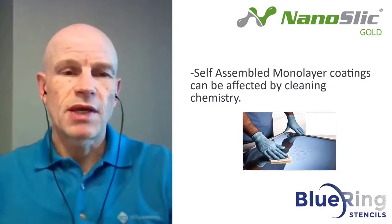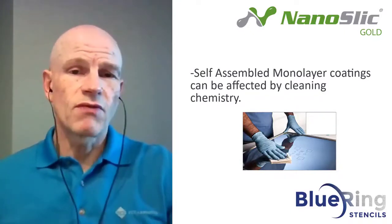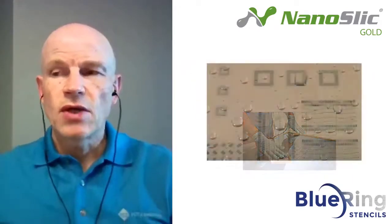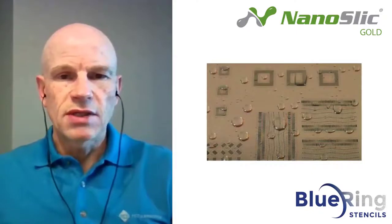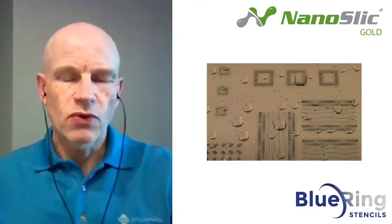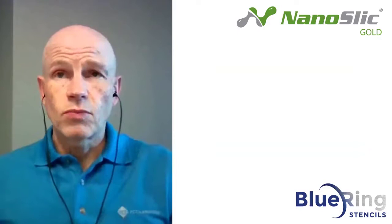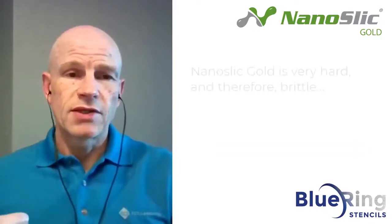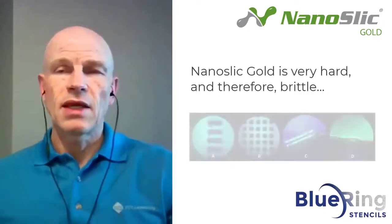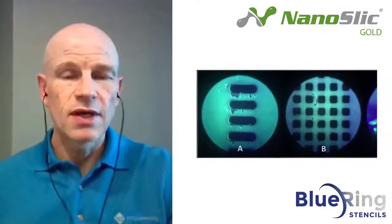Those can certainly be affected by chemistry, dissolved by chemistry, redeposited in some cases, or in some cases dissolved and completely stripped off the stencil. Whereas the NanoSlic Gold coating itself repels most chemistry, and it's sort of like a plastic type polymer. It's very impervious to chemicals. Now the coating itself, however, is very brittle, and so it can be damaged through mechanical means, wear, chipping. Like if you scratch the coating, you can certainly shave it down.